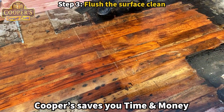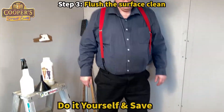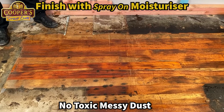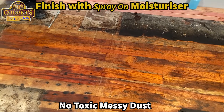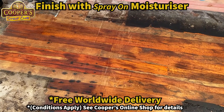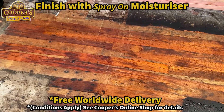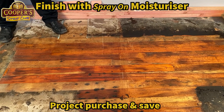And as Dori would say, not the gloss but the colour. It's looking done — that's now a prepared floor. This one's been prepared for our moisturiser. What we discovered years ago is that the wood is already hard. It's had a hundred years of being hardened through time and through being walked over, and the outer surface is as hard as nails. We want to take advantage of that hardened surface.